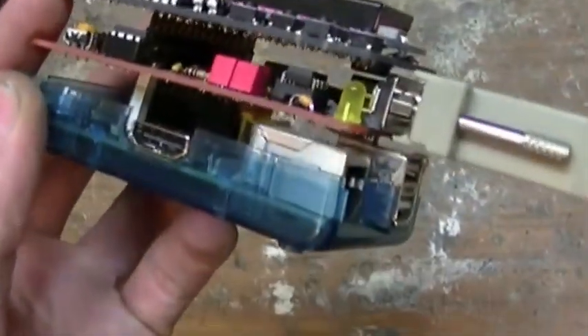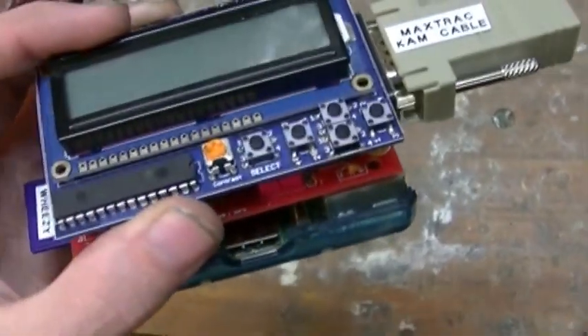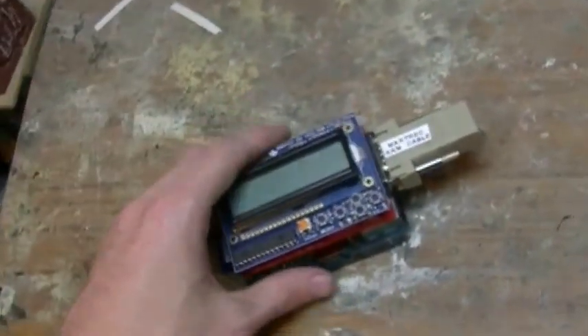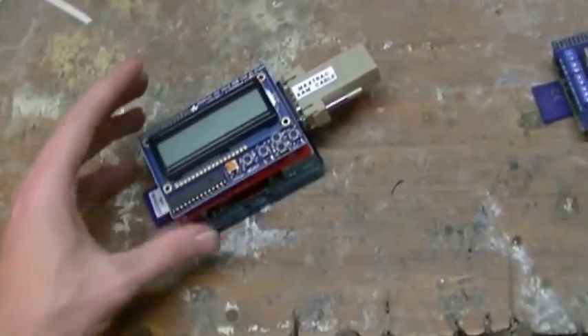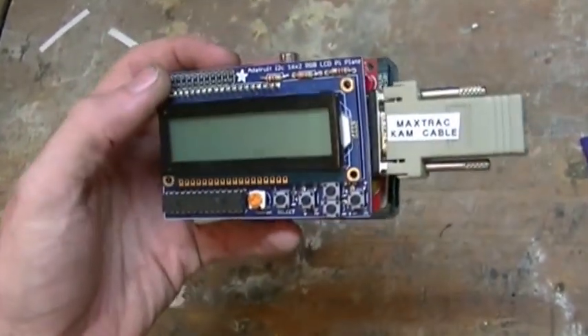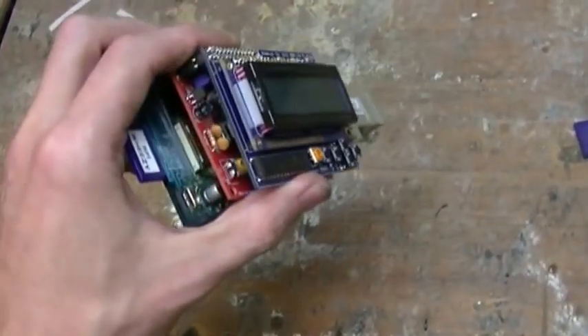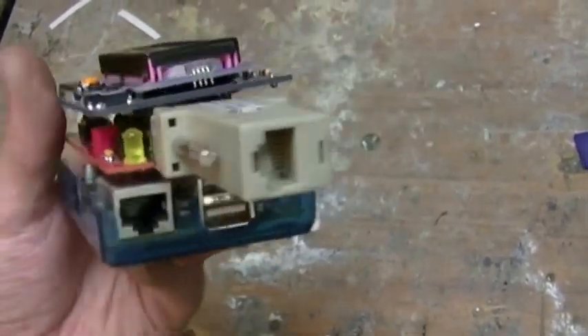Maybe you can even define how tall a plate can be — you know, only three-eighths or three-quarters of an inch high, the connectors have to be a certain height. Make a standard for plates to attach so they don't end up all dodgy like that. Give it some support. You've got your ground and power planes inside the board — you could even bring your 3.3V and 5V power and ground up through those pins, so they don't have to be support-only. Provide power through them, make the thing more stable and less likely to short out. And if you're going to make an enclosure — say with a 3D printer — for something like this Teensy Pi with a display on it, I'm going to have a hell of a time because the plates don't sit level. I'd be willing to pay a bit extra for my Pi and plates if I knew they'd go together and stay together properly.